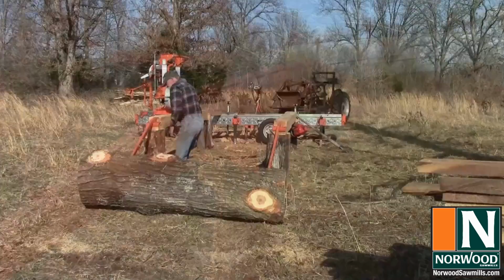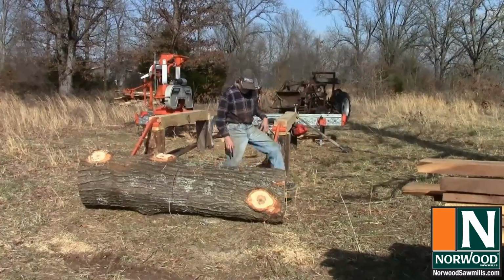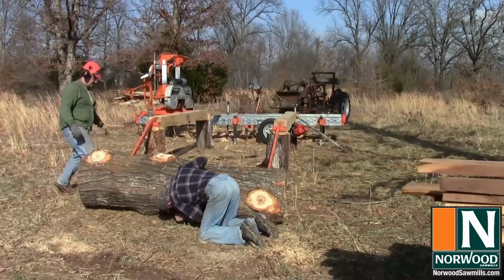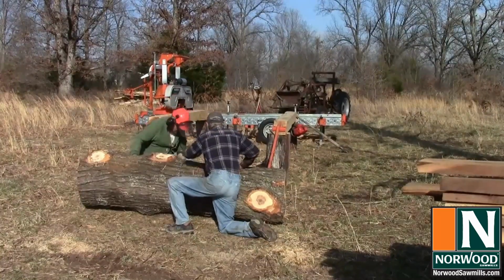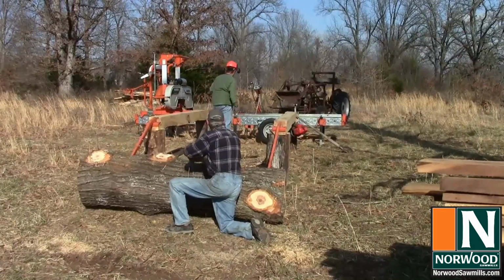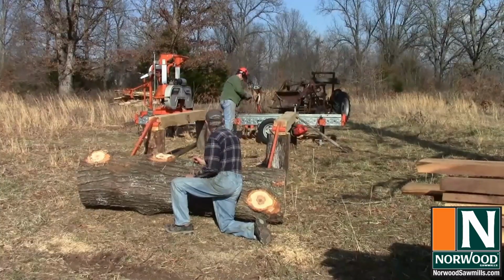The ramps come in handy for the bigger logs, since the old Ford could only handle about 600 pounds. This is a technique known as parbuckling. By passing the cable over the top of the log, then back to the frame, the winch line rolls the log up the ramp. This is my first test of the system using a 12-volt electric winch and deep cycle battery. The winch is rated at about 2,500 pounds.